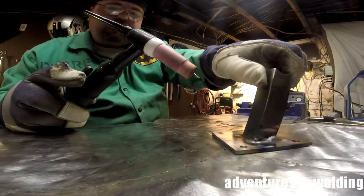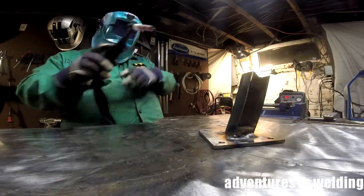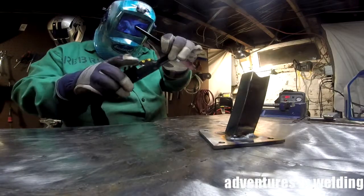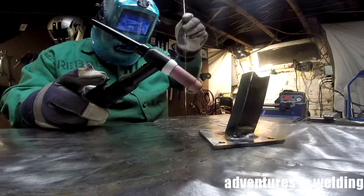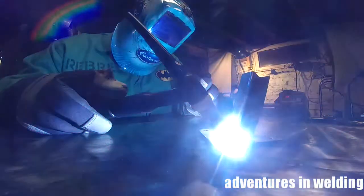I always check my welds after each one. Now look there on that part face, and you see the fillet is good up on the back, and then it kind of drops off towards the front. That's me trying not to burn a hole through here. And off camera, I'm going to go through and smooth these out. I'm not hiding my welding abilities from you guys.